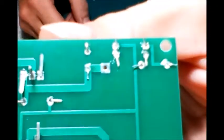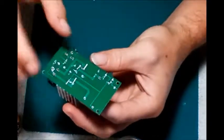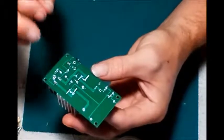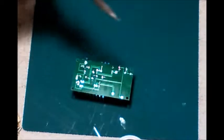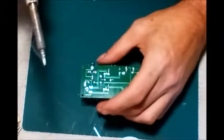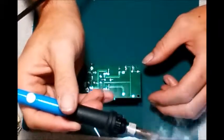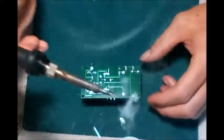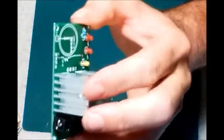Now I've got soldering flux on there - just very little of it. What soldering flux does is help clean the pieces and prep the metal to accept the solder. It also helps transfer the heat better, which means you don't have to leave your soldering iron on your electronic parts as long, because heat can damage them.